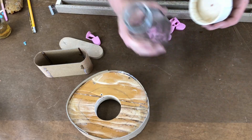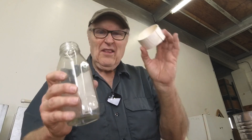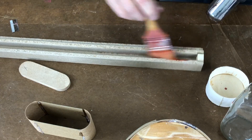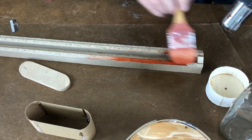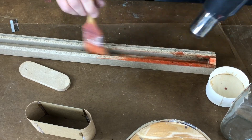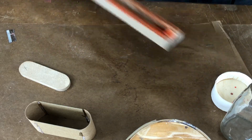I think this is going to work better, so I made a new mold case for the bottle and this is ready to wax. This is the base for where the sculpture itself is going to sit — also ready to wax. So it's wax time. Heat gun — you've got to have a heat gun in this life. And there's always my beautiful beeswax with the red and orange pigment in it so we can all see what I'm doing easily. I'm just going to slap a coat of beeswax on this.